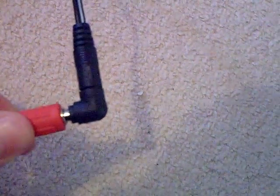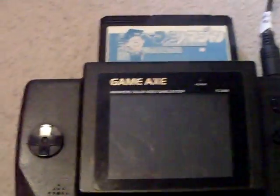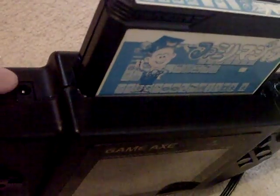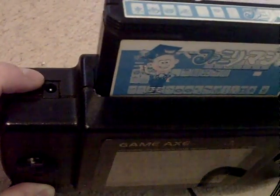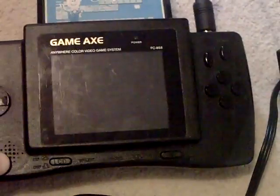As will the power. At the moment I've got the external power for the LCD screen running off a 9V supply. For anyone who's interested, the tip is positive on this interchangeable head. I also did a bit of research last night — the 9V for the Nomad, the tip is negative on that, and it's a different size to the Sega Nomad's input. I think the Sega Game Gear PSU will work, as that's the same polarity. But anyway, let's have a look at the setup.